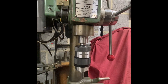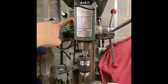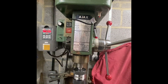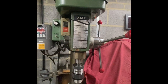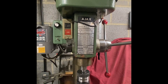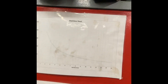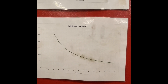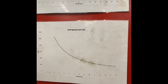The main advantage is that as soon as I've had the variable speed drive and the ability to slow the machine down and basically infinitely set any speed I like, I've not needed to sharpen drills. Drill sharpening reduces right down purely because you can match the cutting speed of any material straight off the bat. To make it easier, I use these graphs which I made up based on the cutting speed for various different materials. On the left is the rpm and the drill bit diameter across the bottom for high speed steel drill bits. You look up to the line on the graph and then read across to the rpm.